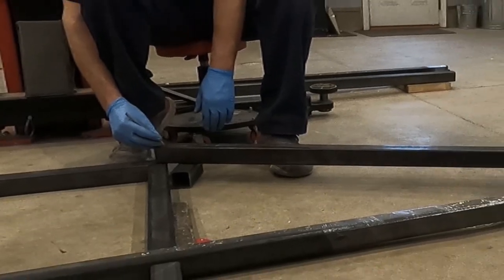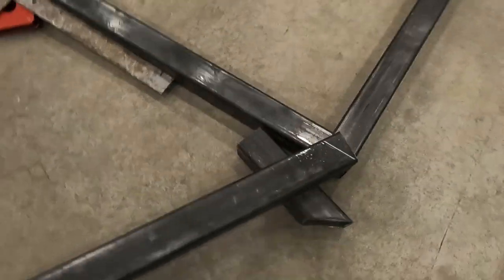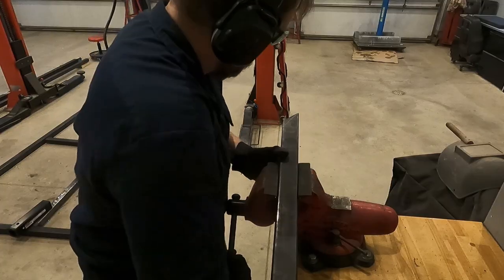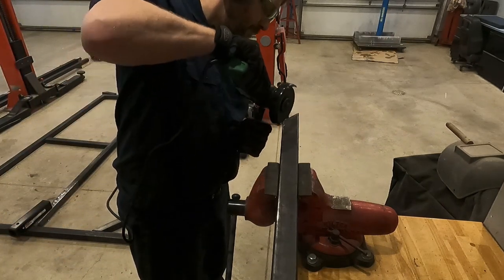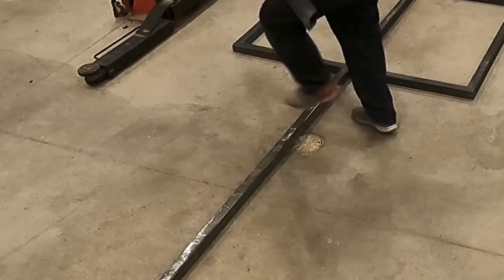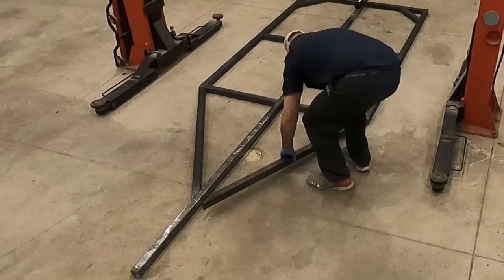For the neck of the trailer, I chose not to do any math. Instead, I just took a piece of steel, laid it on top, and drew some lines about a rough idea of where the cut should be made. It turns out this was a mistake. It took a couple extra cuts and a little bit of extra grinding to make sure that both pieces were exactly the same. Some of these angles were a little too sharp for my cheap chop saw, so I used an angle grinder and just cut it by hand.